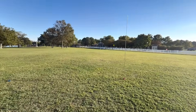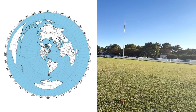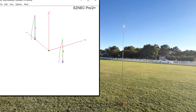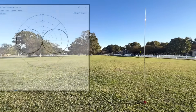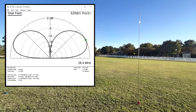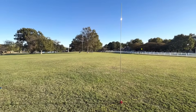There are the two antennas — I am aiming 240 degrees, at the dead center of New Zealand. I always jinx myself when I say where I'm aiming. One side is New Zealand; the other side is across Spain and the Mediterranean. I modeled it at half wavelength, then pulled it apart and modeled it at five-eighths wavelength apart, and the bidirectional gain was a lot better. Pretty good takeoff angle. Let's get on the air with the co-phased telescopic whips tuned for 10 meters.